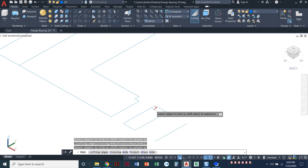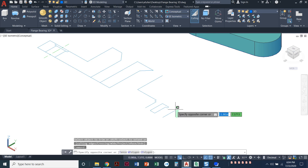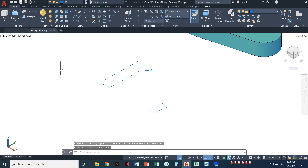As I do the revolve command, I actually don't need this little piece right here — I just need this shape. I'll trim up here as well and erase out what I don't need, because I don't want to get confused with too many extra lines. Once that's done, I can erase out all this other business. All I need is half of that countersink and half of that counterbore.